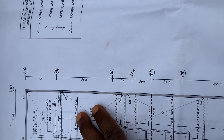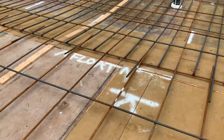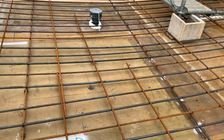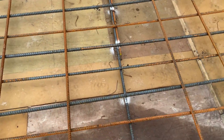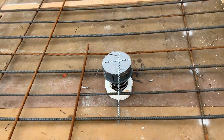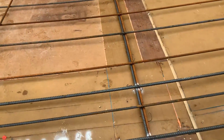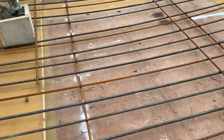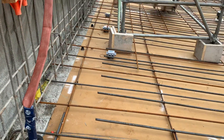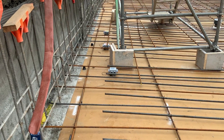Before you cross it off, you make sure you have these bars going east to west — you have them in. Especially on the east side, this side of the building. You see them in — this one, this one, this one — these are my extras, I have them in. They come all the way and they end here, 19 of them. They end right here, and they go at 15 inches. So all the bars now running through the wall — they are my extras.